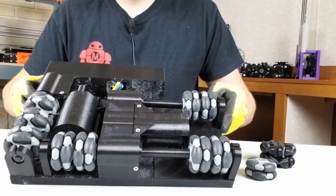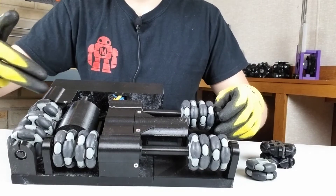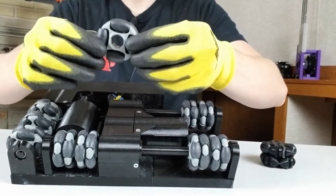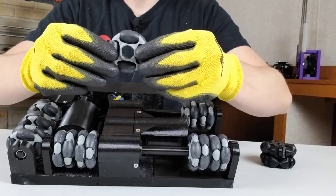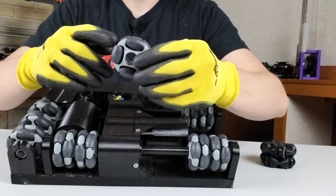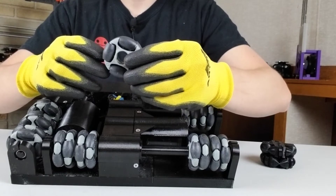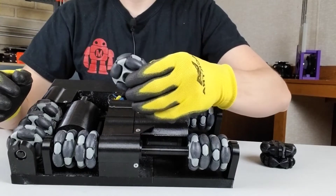Here's a close-up of the shoe as it is right now. These three wheels here are for forward and back motion. These six wheels are for side to side motion. If you combine them you can go at diagonals. Here is the wheel that I bought — it's a rotocaster wheel from a company in Australia. This little guy can handle 30 kilograms of weight, which is about 66 pounds. It's 50 millimeters or about two inches in diameter, about one inch wide.